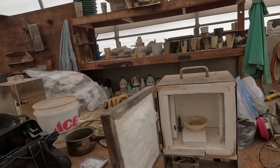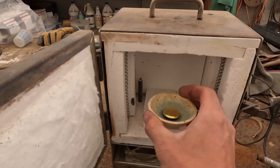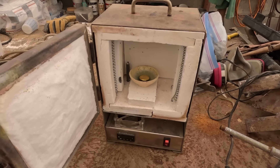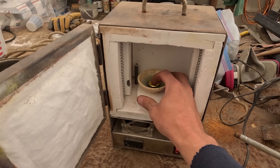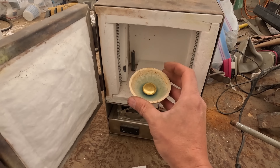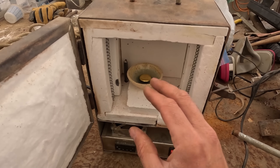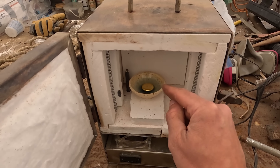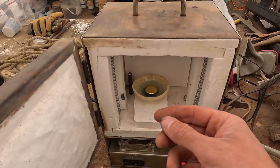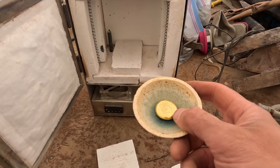So I'm going to try and explain what I've got set up here. Everything's cool now, it's not plugged in. The idea is we're going to take our little melting dish and our gold. There's a little bit of borax in there that's going to absorb any oxides we create from oxidizing the base metals. You put this in, get it up to about 1,900 degrees Fahrenheit, the gold melts, the oxides form a little skin on the surface and roll off, absorbed by the borax. But this button just has a nice mirror finish — no oxides forming. When I blow on it though, you get a little oxide skin forming, which means there's a little bit of junk still left in this gold button.